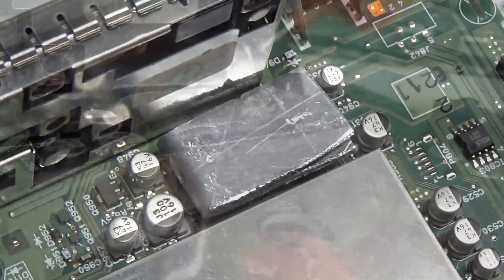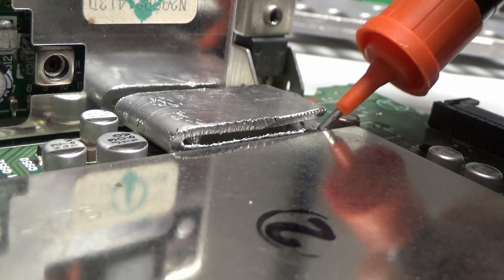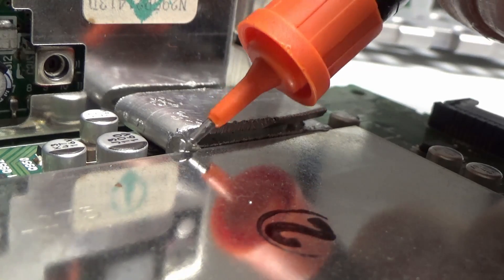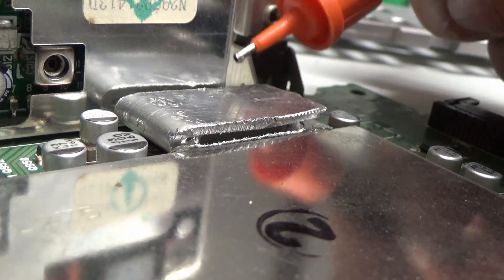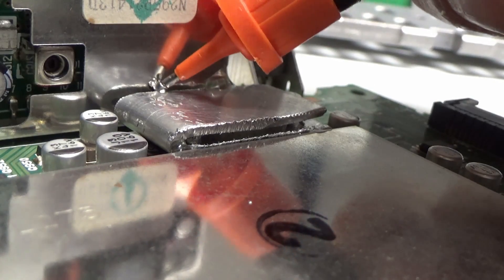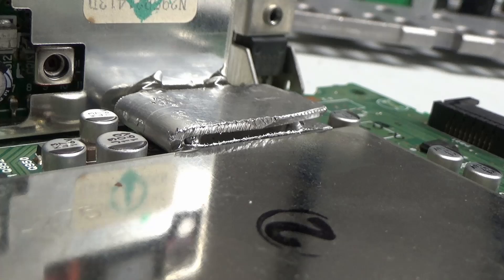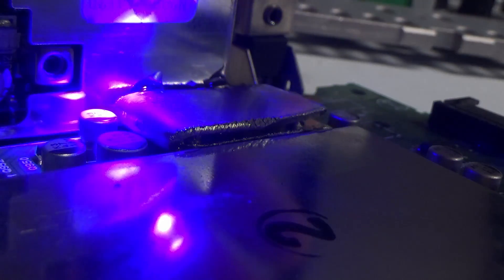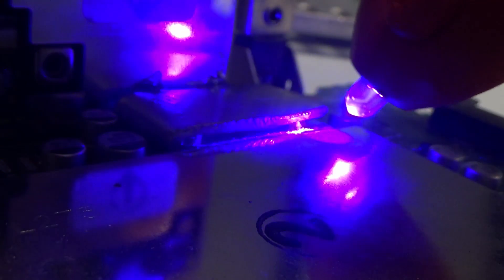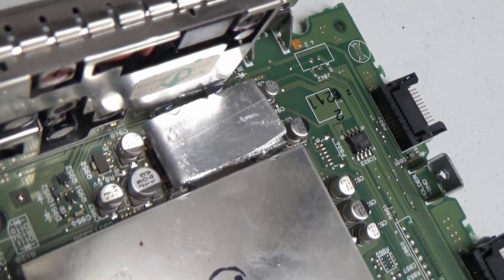On the other side we need to replace those two resistors. Let's get a little bit of this ultraviolet curing glue stuck in place — a lump on there, and a lump on there. This will just stop things from potentially moving around whilst the vehicle's in motion. You clearly want to make sure that the heat sink stays in place. The good thing about this UV glue is you can cure it with UV light — shield your eyes, folks — there we go, that glue should be going off now. Right, that's going to work a treat. Okay, let's get the resistors sorted.